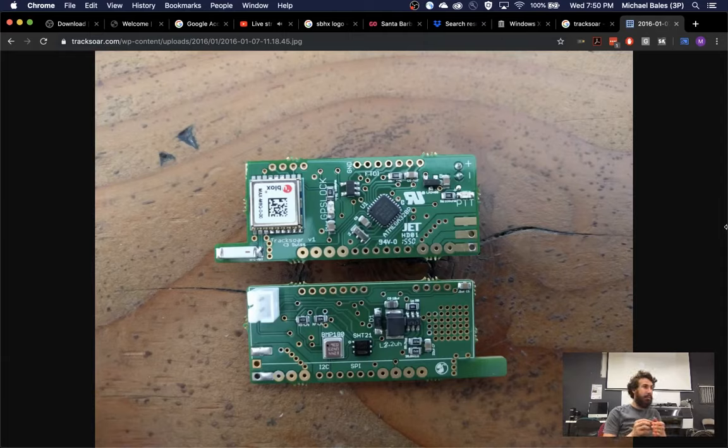Is that just hanging loose off the balloon? I generally use servo pushrod tubes. They're just kind of big plastic straws sticking out of the payload box that hold it stretched out. Ideally, most repeaters are vertically polarized, so you would have it set up vertically. But the losses are minimal enough that running it horizontal is just easier.